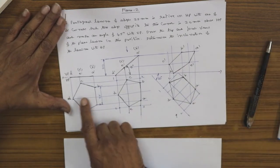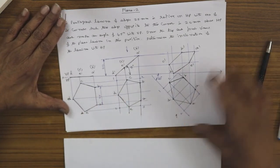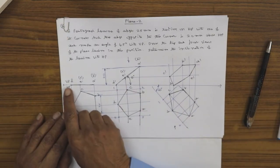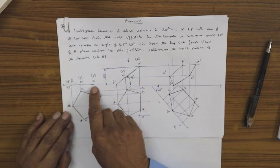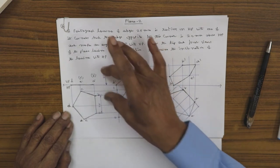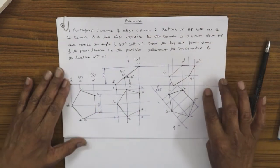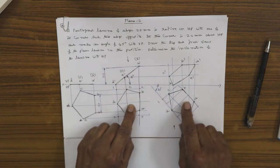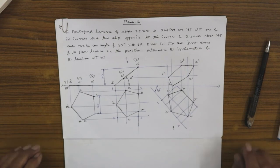So, the initial figure, the first step and the second step. In this problem, you have to measure the angle here after getting D and A with the compasses, cut off DA between the two lines, 20 mm height and the XY line. You get this angle, measure it, draw the top view, get the front view. That's the final answer for the present problem.